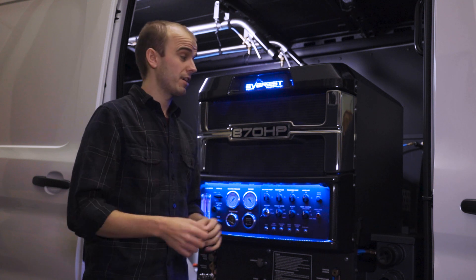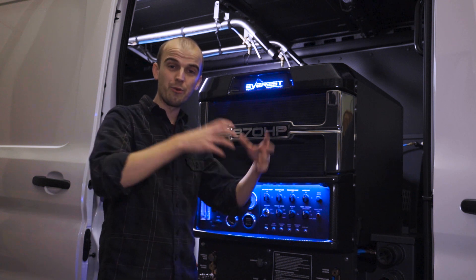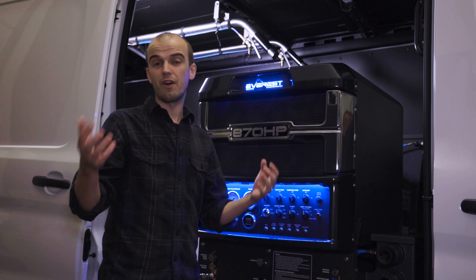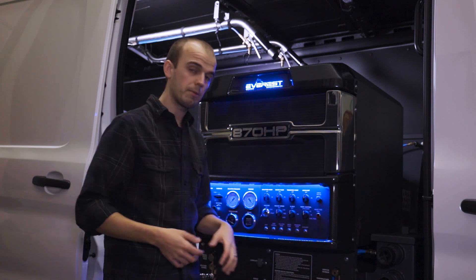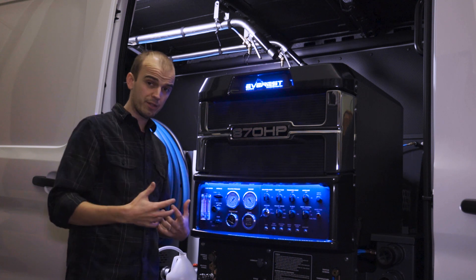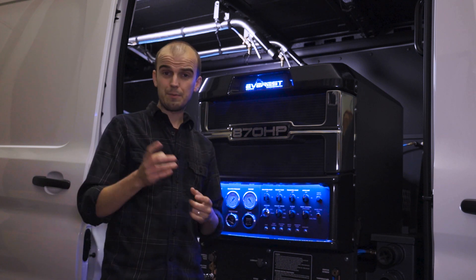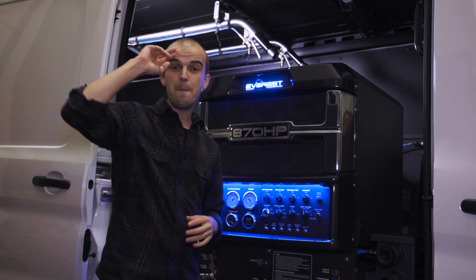A couple of words. First, remember the best way to get through this cold season is actually just to keep your work van, truck mount, and all accessories within a heated garage. This method of winterization is only advised if you can't do that. And secondly, when you are running the truck mount — like we did just then to run the antifreeze through the chemical metering system — do it outside. There will be carbon monoxide being emitted from the truck mount as you're doing that. If this video was helpful for you, please hit that like button, subscribe to the channel if you aren't already, and wherever you are, stay clean.